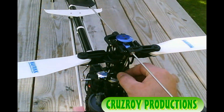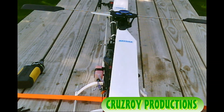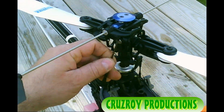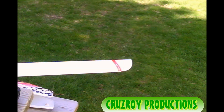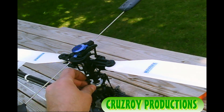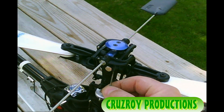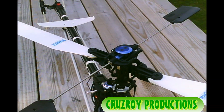These bars are set by the manual at 100 millimeters. So the red tip is up too high — it needs to come down a little bit. We need to tighten the long rod here. Here's the long rod for the red tip. The way it's set right now the red's too high, so it needs to come down — that means I have to shorten the length of the rod. Without using a tool I'm going to make one complete turn — that's a half, and that's a full turn. Make sure your alignment's okay because one of these is 90 degrees to the other. Let's try it out.